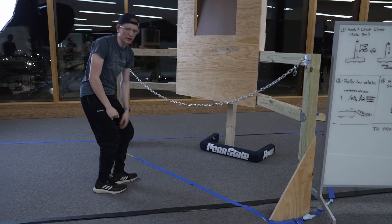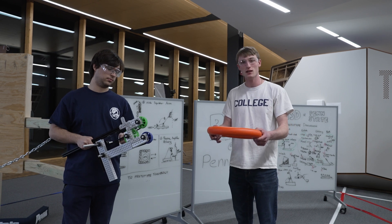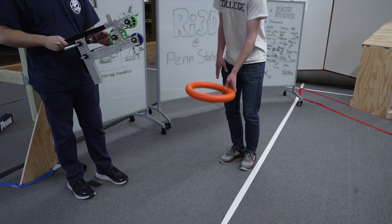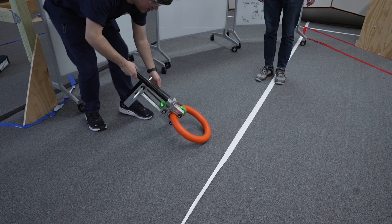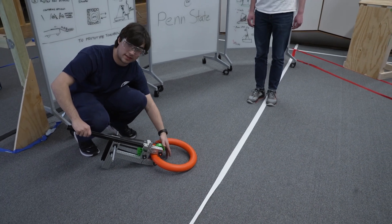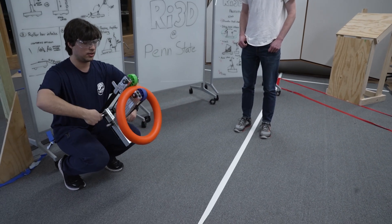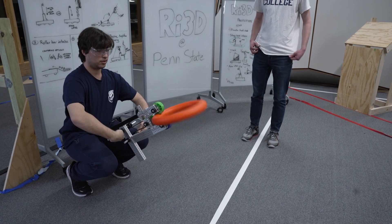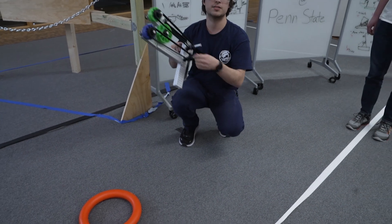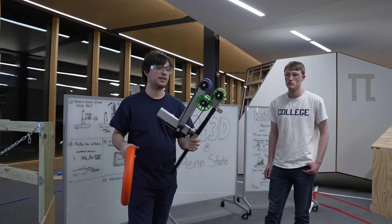This is a simple intake design. It uses two rollers to suck the ring in and then holds onto it. It's not powered by motors right now — just by hand. It's able to pick up off the ground from around a 45-degree angle all the way up to vertical. If you wanted to get it lower, you could move the wheel forward for more overbite. Using both wheels you can rotate the ring around, back and forth, up and down — holds it pretty steady. When you're ready to deposit, you rotate them together and it deposits just fine.